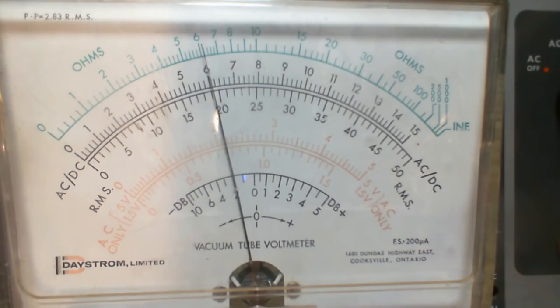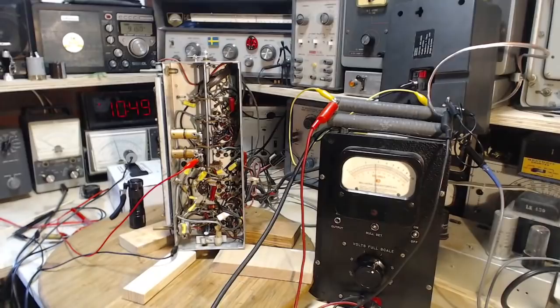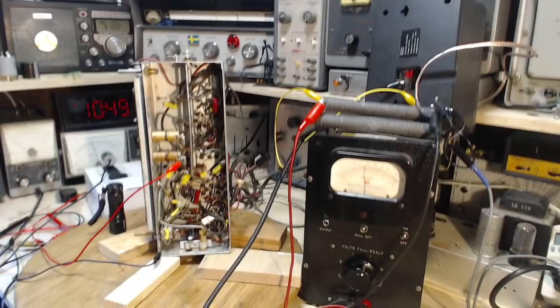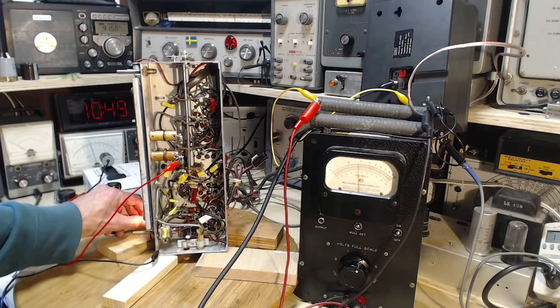Now if you look at our other output indicators, we're just about exactly 3 here. The fact that it's off a bit is probably just the volume control. And the signal, of course, looks great. Let's fool with the tone control. I think I left it up high, so it'd be not depleting the treble. Let's make it deplete the treble. On there, you can see that it's got quite a strong effect, in fact.